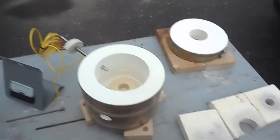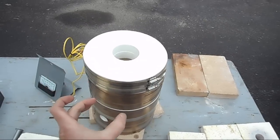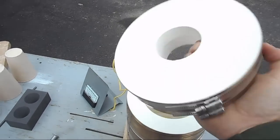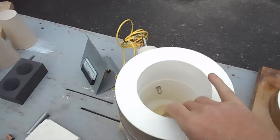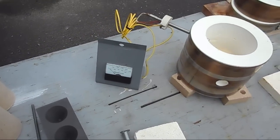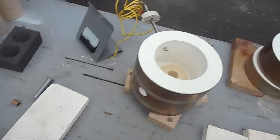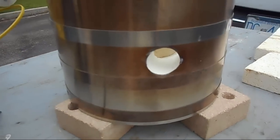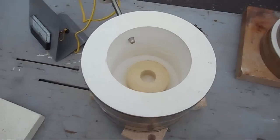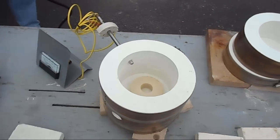It's made in segments so that as you're pulling your crucible out, you can take it down to the halfway point and easily grab that crucible and pull it out. Nice stainless steel outer bands that can be tightened to keep up with the shrinking of the refractory material. We have a pyrometer to tell us how hot it's getting inside — it's supposed to be just barely sticking inside the flame port. That little brick inside is just to keep the crucible sitting up a bit so you can grab it easier. Very nice, clean, and well manufactured.